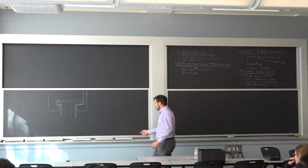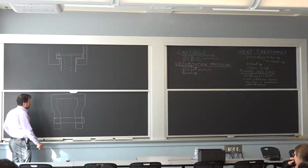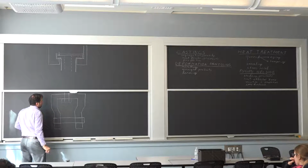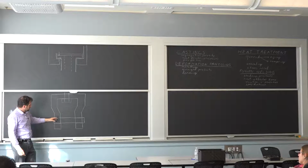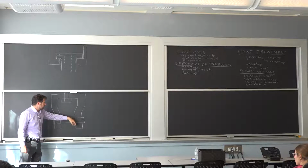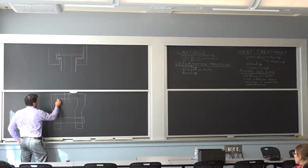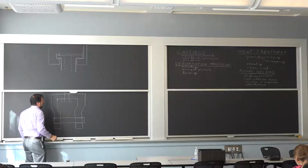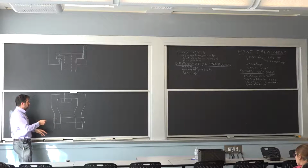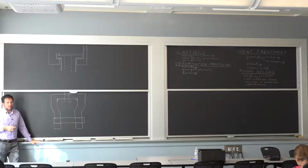It happened recently. I had a project that was using an aluminum casting, and it's a yoke system. So what happens is over here, you thread in a rod, and that goes for a hoisting mechanism up on top. And then here you had a pulley to carry the load through a number of cables. So we're just looking at essentially that U shape that was cast aluminum. And they had the very same problem where this corner here was sharp. Now, this is, to me, even worse, because there's just absolutely no reason why it would be a disadvantage to just round the mold in those corners to create yourself a good radius.